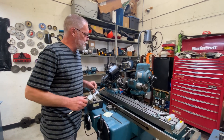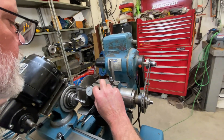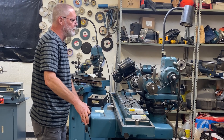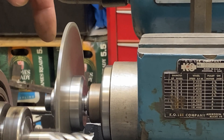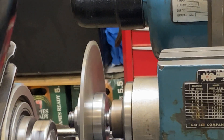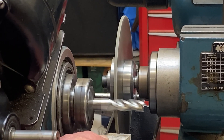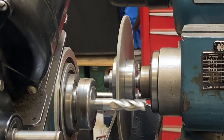I won't trust that, so I'm going to double check and make sure everything's right where I want it. You can see the glare on the diamond wheel here — what that means is that its pores are all plugged up with carbide and it's going to be generating more heat than it needs to. So I take an aluminum oxide dressing stick and just rub it on there. You can see it's freshening up the surface of the wheel, clearing out those pores, getting rid of that shininess — and it won't cut so hot now.